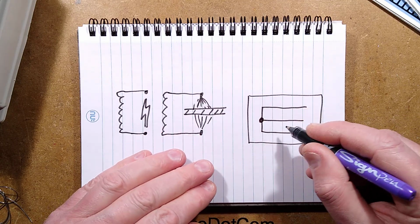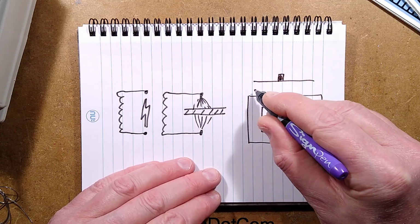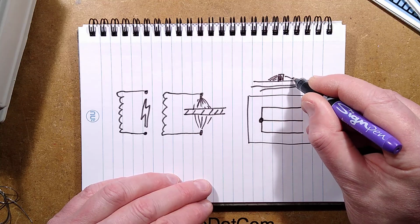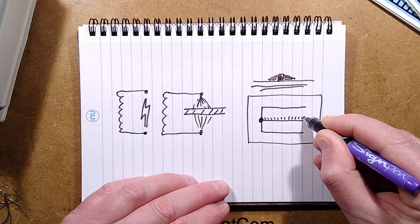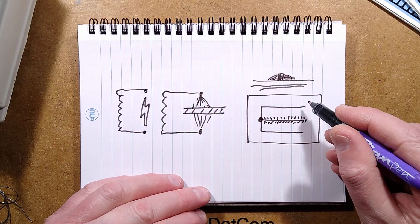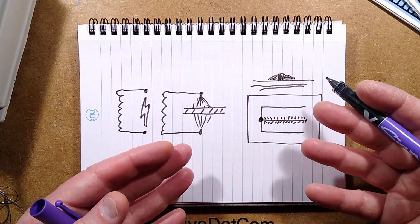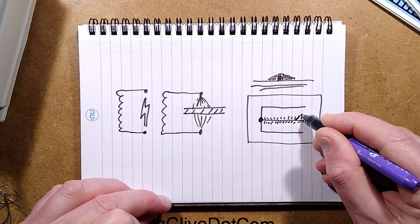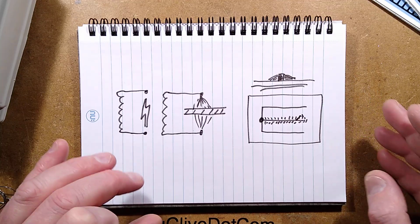And what happens is that if you were to see that from the side, with the raised electrode and the conductive layer at the back, you'd see a corona discharge fingering out from the side there. And what that results in is a glow that follows the outline of these tracks. The higher the voltage goes, the more they spread out, until if you go too high, the ceramic, even though ceramic's got a really high voltage rating, can break down. If that happens, you'll suddenly end up with a crack. It'll pierce it and it'll start glowing and burning at that point. I had that when I did it with glass.